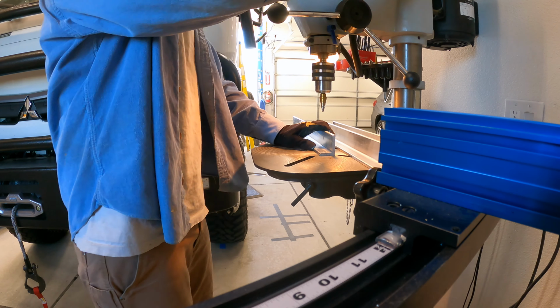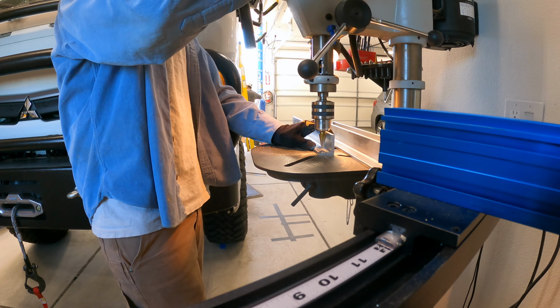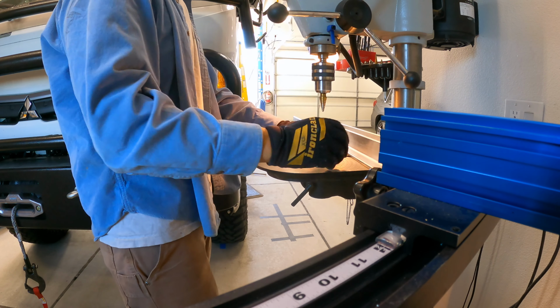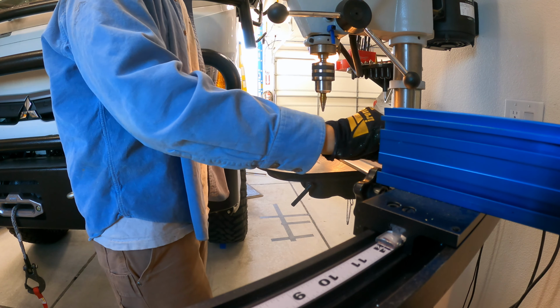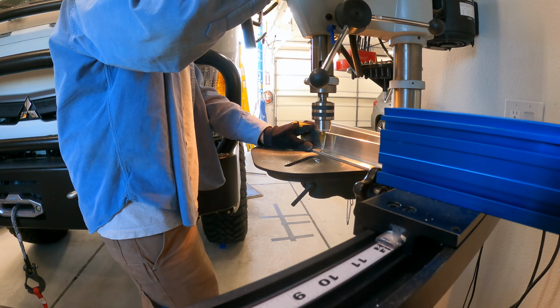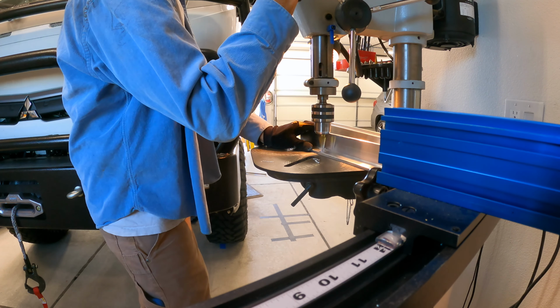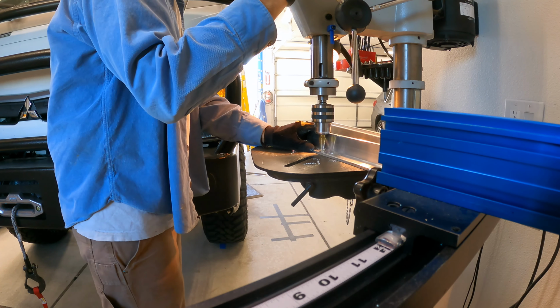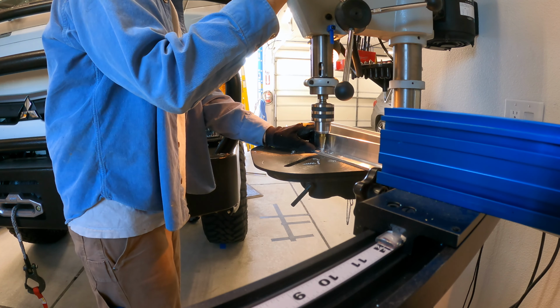And I'm sure you're asking, Casey, why are you using aluminum instead of steel? There's a few reasons. One is it was somewhat what was available to me as far as supply chain issues at the time for the different components. It was also something I can work with using available tools and skills that I have. It's also something that won't generally rust, although it is connected to a steel frame, so it's going to be the corrosion point.